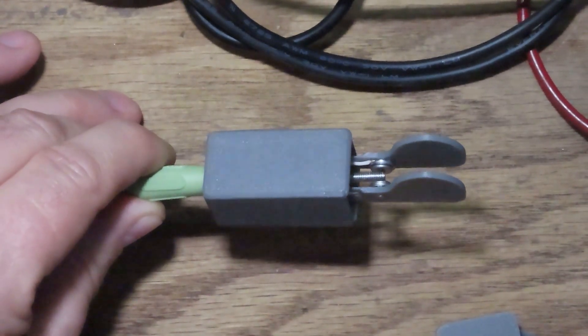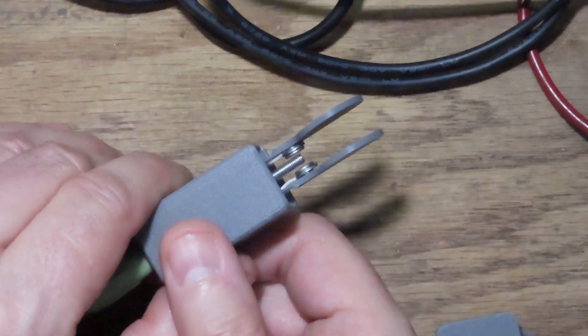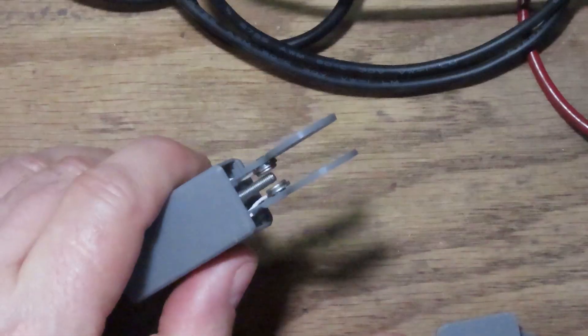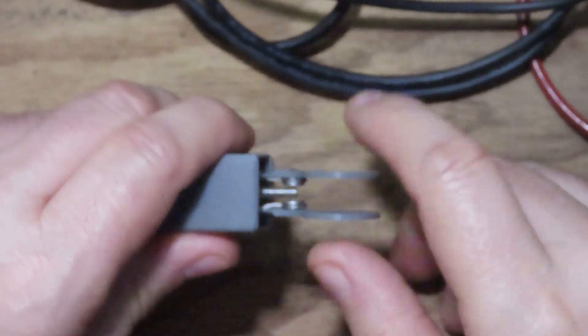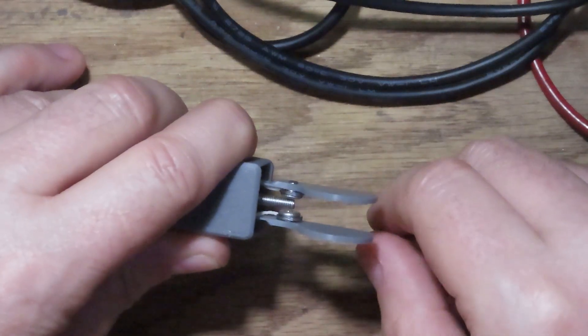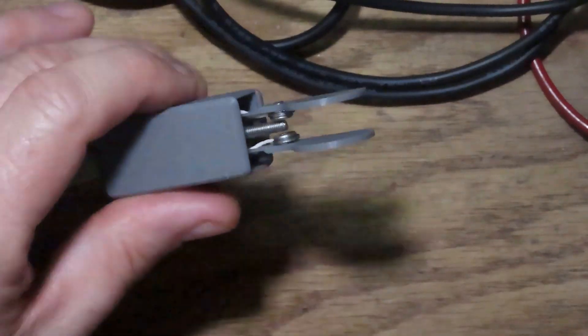After a little bit of soldering and assembly, there it is all put together. I did have to tweak that screw in the middle - sometimes those are bent a little. I found you can take small needle-nose pliers and just put a little bit of torque on it to bend it slightly to really dial in the gap so that they're the same. I've got the radio on and I'm plugged into it. Let's see if they work. They work! I'll take that out of CW mode so I don't accidentally key it again. So yeah, they work fine.